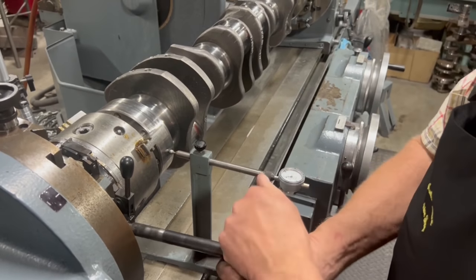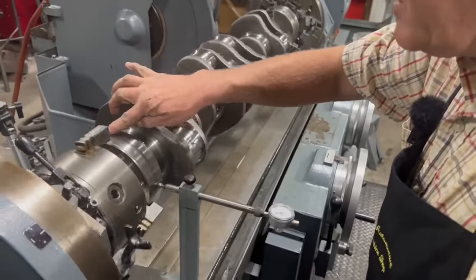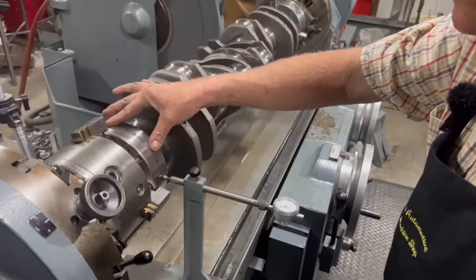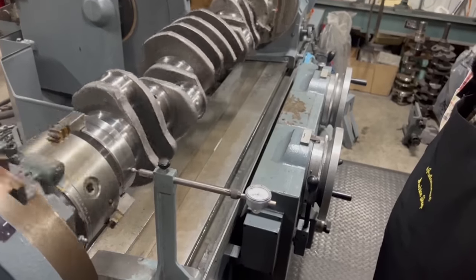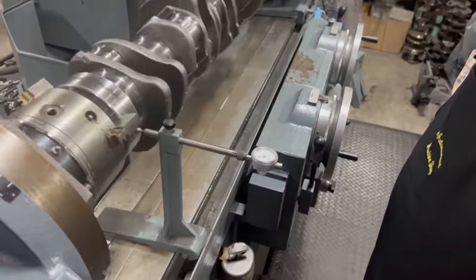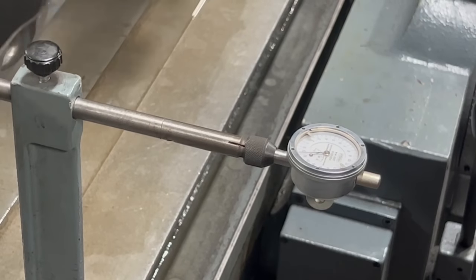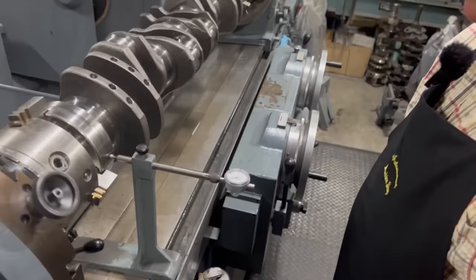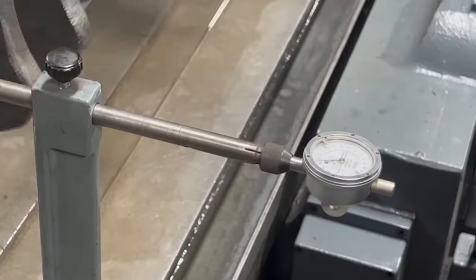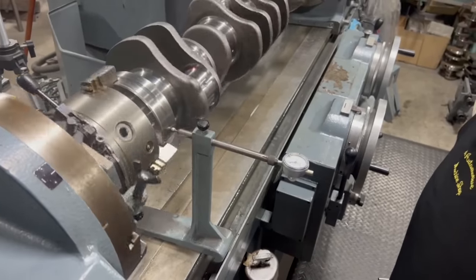You said he might do a speedy sleeve? Yeah, he was talking about wanting a speedy sleeve. I wouldn't put one on the back end. I think that's plenty good yet. No reason to put a speedy sleeve on there, but that definitely has a bit of a low spot in there. Just all of a sudden it dips into a spot. Huh. Well, it runs pretty dang true for the rest of it.